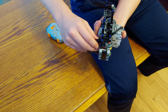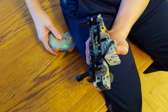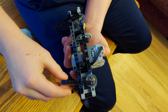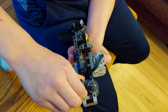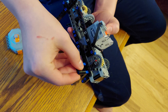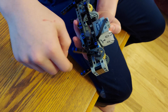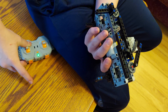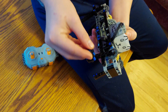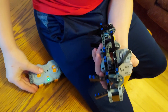It uses these gears. As the motor turns, you can see how the beam goes down and then back up and down. And then I used a three-stud long piece and then these spacer pieces. It kind of holds it in place so it doesn't go all over, because it doesn't really work when it's loose like that. But when you can hold it in place, it also gives it wiggle room so that it can actually go to different angles.